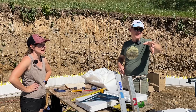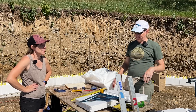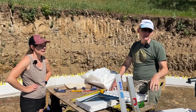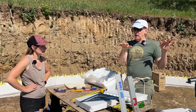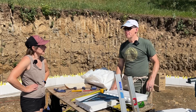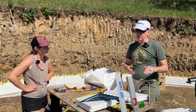Yeah, at the southeast side the cement was up higher, so we didn't quite get it leveled when we poured. I had to do some trimming. I went around the inner ring and got that all level, and then leveled the outer ring — went all around that. Leveling it with shims or a combination of shims and having to trim a little bit.